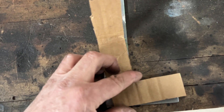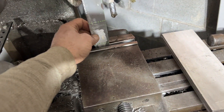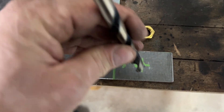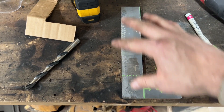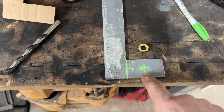What's great about cardboard is you can just straighten it out and mark your bends. I do have a hydraulic press but I don't have a great 90-degree bending jig for it, so I'm actually going to mount this in the big vise on my Bridgeport and bend it with a hammer. I made a mistake on the first one — I started bending in the wrong direction. On the second one I think I have it now. I'm going to drill this hole first while the part is still flat and easily held. I always tell you guys — try to do whatever cutting and drilling you can before you make the bends, because once the bends are in it gets awkward.